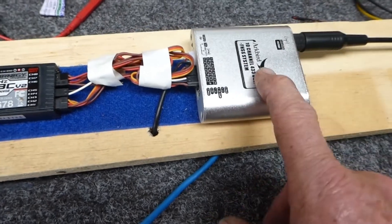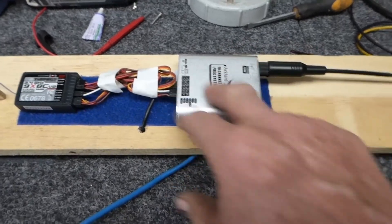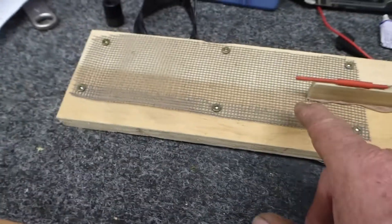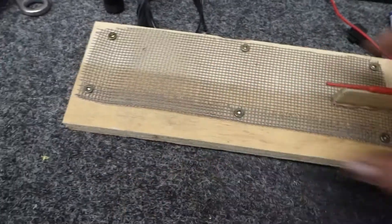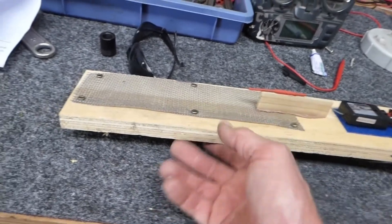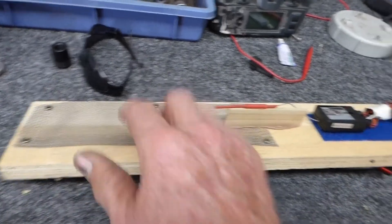The radio talks to that and then that talks to this, turns it into UHF, and the UHF has got across the ground supposedly 400 metres. Line of sight up in the air on a plane it'll probably get about 28 kilometres — I've heard of them doing that. So here's the aerial for the receiver, and I've put a little grid on there. The grid on the other side is the aerial for the FPV which is 5.8 gigahertz, and this is 2.4 gigahertz. That one's transmitting and this one's receiving, so I've put the grid in there to give it a little bit of headspace.